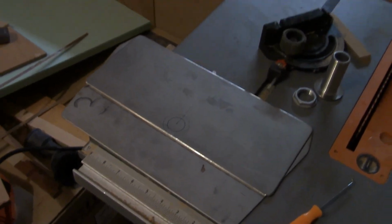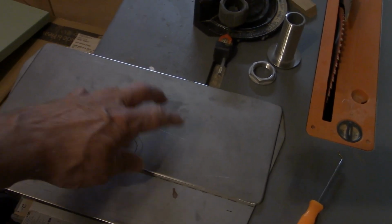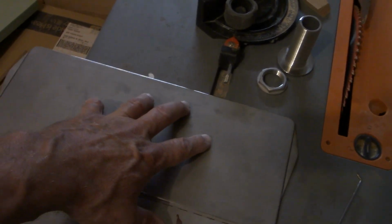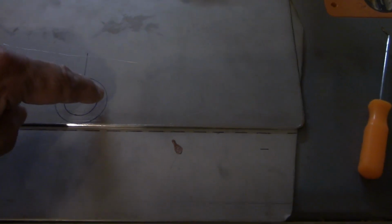Now I need to turn my attention to those pieces of stainless steel I showed you a couple of months ago. These are going to mount on the transom, one inboard and one outboard. They're going to be bolted down, and that's where the outboard's going to clamp. And remember I said these are wear plates. This is to keep the clamps on the outboard from wearing into that wood right there. I've got to get them drilled up. I've got to bore a big hole right here for a through hole drain, and that's because, remember I said, this area right here will be boxed in.